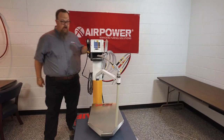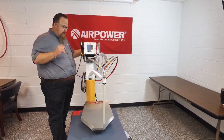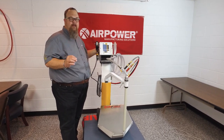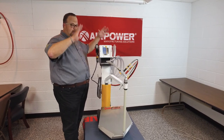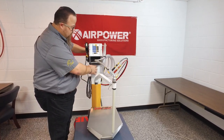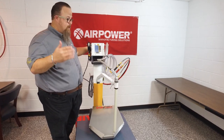You'll also notice that the swing arm has been lowered, which gives us a little bit better position of the pickup tube, slightly lower in the box. Here is a brilliant addition to this unit — see this new color on top? This new color everywhere up here is actually an anti-static coating. This will not as easily attract powder. So when you're spraying and moving around parts with a lot of powder moving in your booth, you'll notice that powder can come back and build up during color changes. You're not going to see that as much with this unit. That anti-static coating will keep that away and help with quicker color changes.